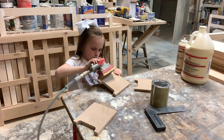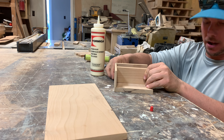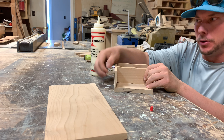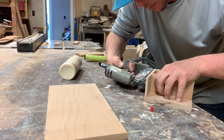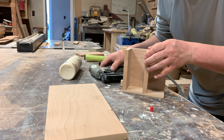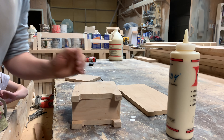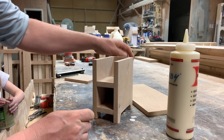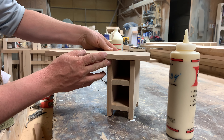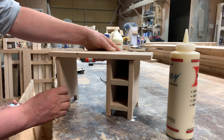What are you doing? Drawing. All right, we're putting our shelves together right now. We've got the back end and one of the lower shelves — I've got the other shelf marked out. We're putting it in here and then putting one inch pin nails through here to hold it, and we are gluing it in. Stick the glue right here, line this up and shoot a pin in. Flip it over and shoot a pin in to hold the shelf. Get everything squared up and put a few pins in to hold it till the glue dries. There we have the side cubby, which the desk will fit on top of just like this, and then our other side is going to go just like this.